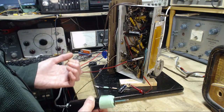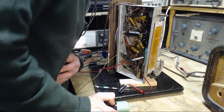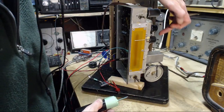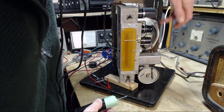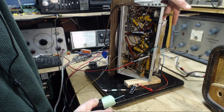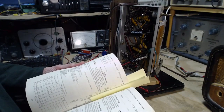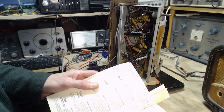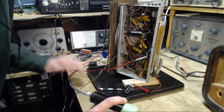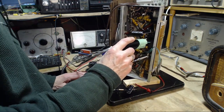So we come back further. You could look at the input to the inverter tube. That'd be the 6J. You know what? I've been doing this wrong. This is the 6SQ. This is the 6J here. So when I thought I was listening to the plates on the 6SQ7, I was not. 12SQ7, 3 and 4. Yeah, because I noticed before that 3 and 4 were not tied together on that tube. So that should have been the hint right there. I was on the wrong tube.